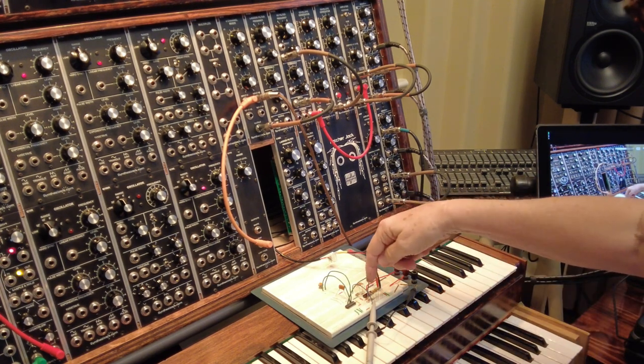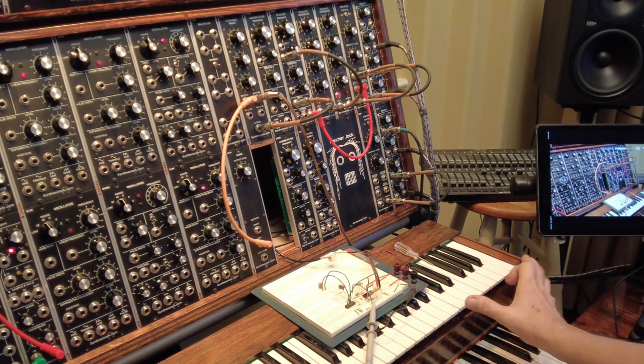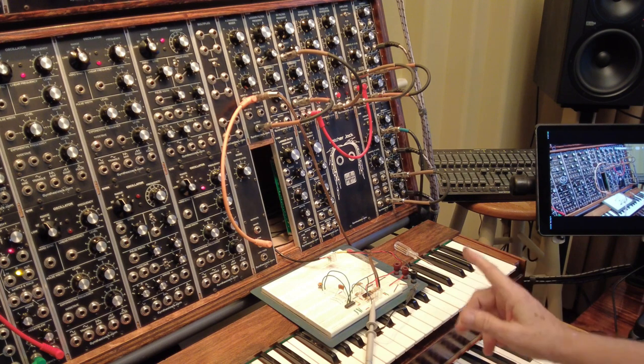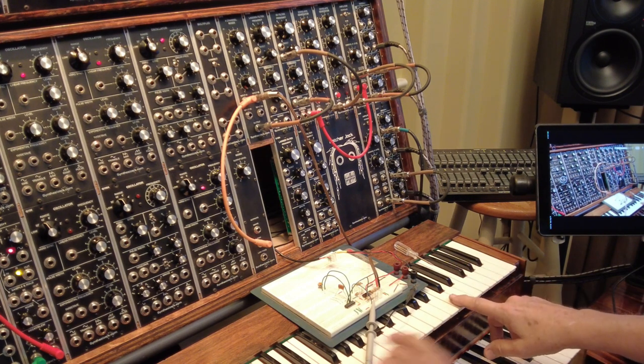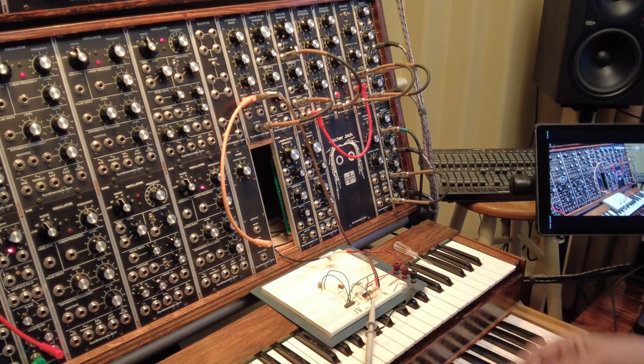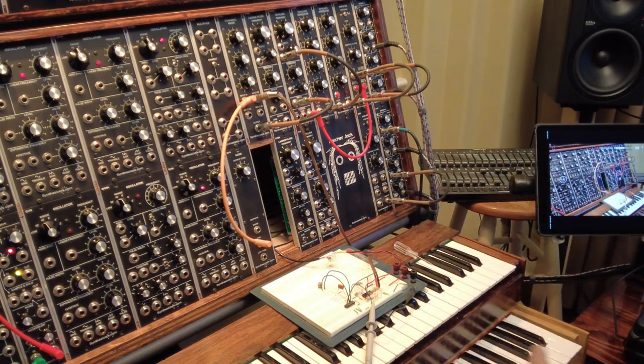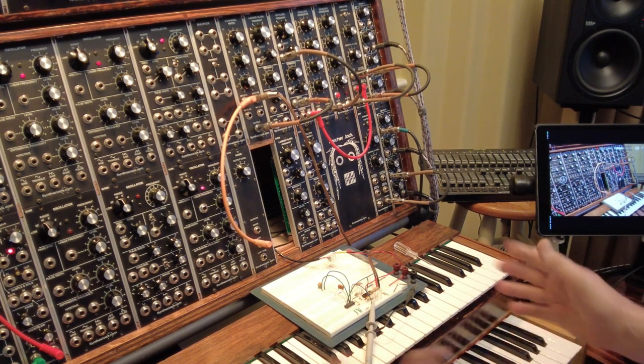This chip literally creates the 12 or 13 tones of the top octave from here to here. Then you would have a six-stage divider and hook it up to each note to get your down octaves. So you're looking at a single chip for the TOS and then 12 six-stage dividers to get your lower frequencies.